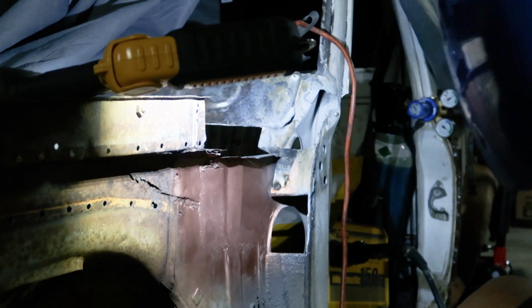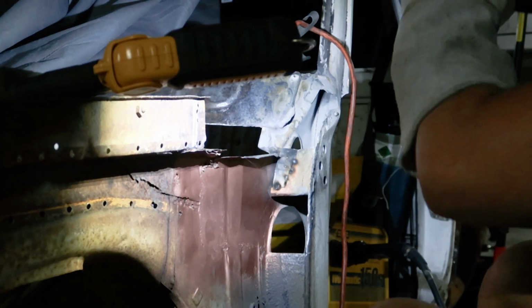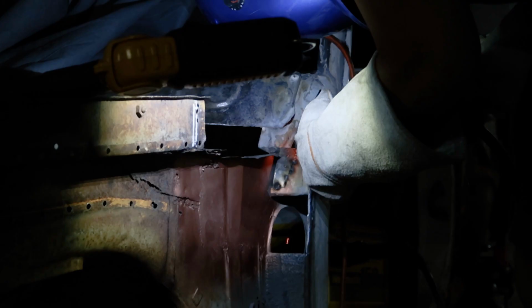To summarize, I started out with flux core MIG welding. I was finding it near impossible for this application, and eventually switched to gas shielded MIG with 0.6mm wire. This straight away gave me way more range to play with for my settings.